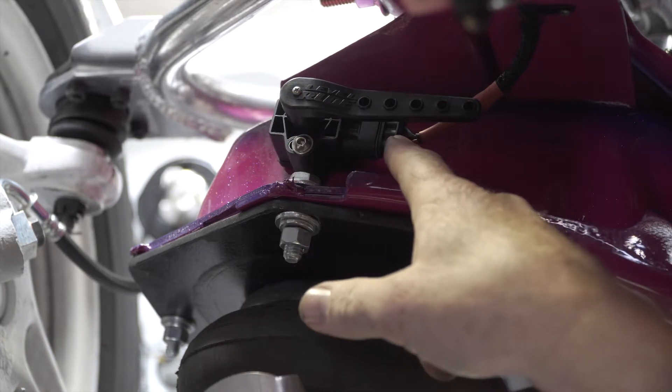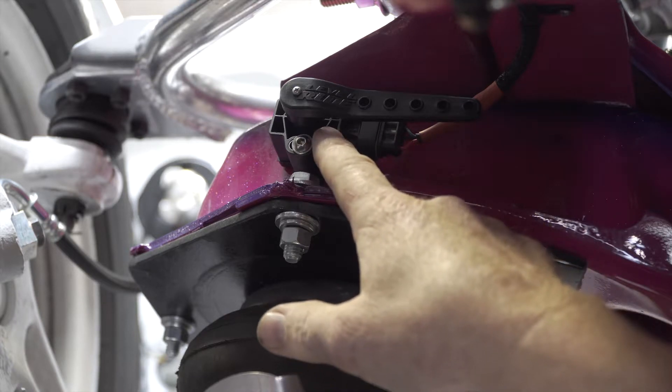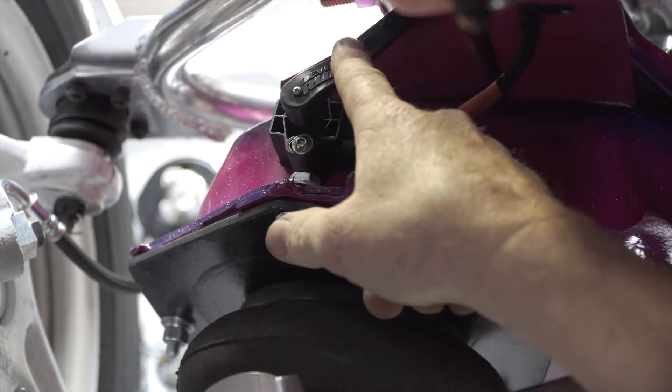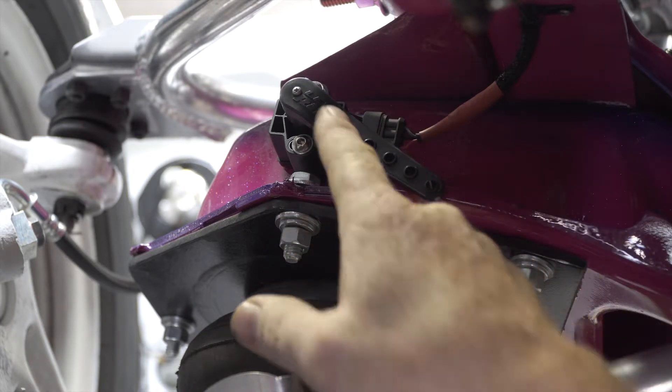To save space on this one we have the plug at the back. We've indexed it so that it's now facing the rear at the middle of the travel. When the vehicle is down the arm will be up here, and when the vehicle is up it'll be the other way around.